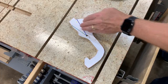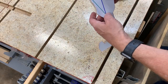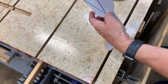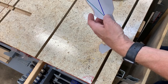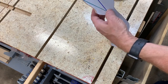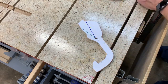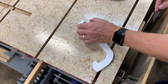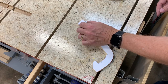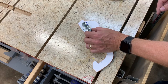The blue line and green line on the template mark the upright locations of the arm when it's in the pre-prime and the primed position. So we need our weights to be in that area in order for the center of gravity to fall over center. I've found it's best to line them just inside the blue line, so I'm going to line my weights up just inside the blue line and get those screwed into place.